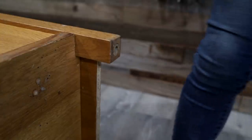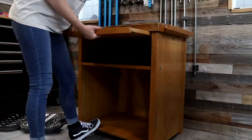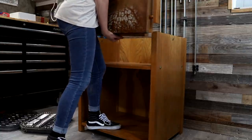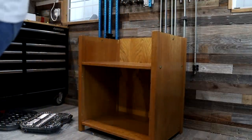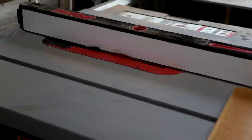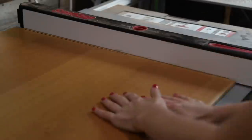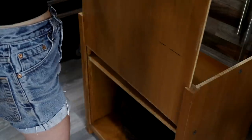The first step in this project was deconstructing this cabinet once it got into my workshop. I legit thought I was gonna have to cut the top off — but it just comes right off. That could not have been easier! I was so happy that top came off so easily because the first thing I wanted to do was replace it with a butcher block top. So I took that top right off, trimmed down the back of the cabinet using my table saw, put that back in place, and then it was time to focus on some other areas.